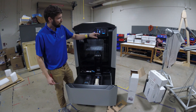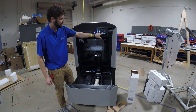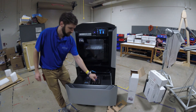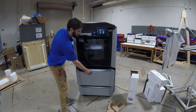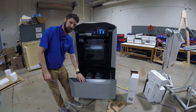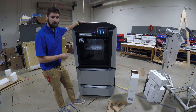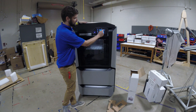It has detected the support material — still unloaded, QSR white, 60 cubic inches out of 60 cubic inches. I'm going to hit load; now it's pulling the spool in. It's going to repeat the same process. Close this top door, close the material bay — you can open and close the material bay while it's loading since there's enough slack in those tubes, so no problem there. We're going through the process where the head is going to purge the material, and after it's complete, we'll see that this head is loaded, it's blue, it's ready to go.